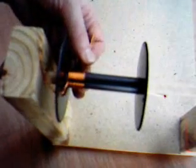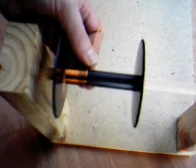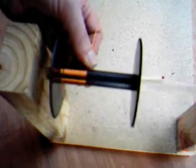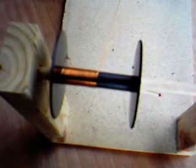As you can see, the wires have started winding from the left and moving to the right. It'll take roughly 50 winds on this particular spool to fill up the bottom. When we get to the right hand side with the 50 winds, we simply just start feeding the wire backwards for another 50 winds. Keep repeating this process until you fill up the spool with the number of winds that you require.